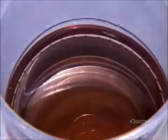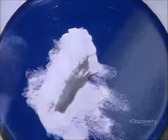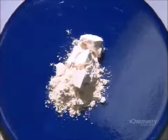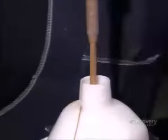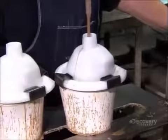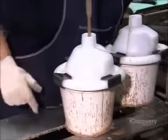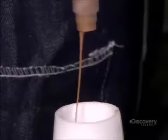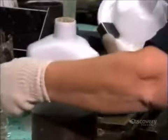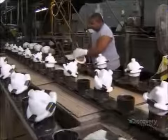They make the cores from polyester resin, blending in minerals like barytes, silica powder, and limestone. The result looks like chocolate milk, or make that hot chocolate, because a catalyst triggers a chemical reaction that heats it up. As they pipe it into the molds, it quickly starts to cure and solidify. In just 2 minutes, it's ready to extract.